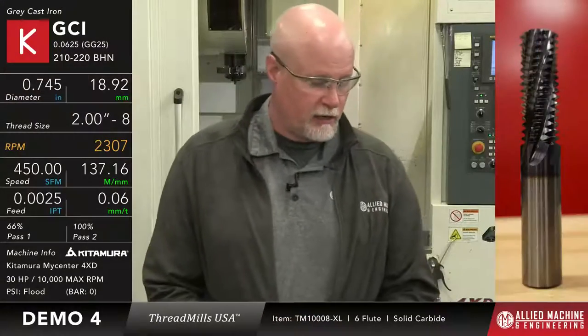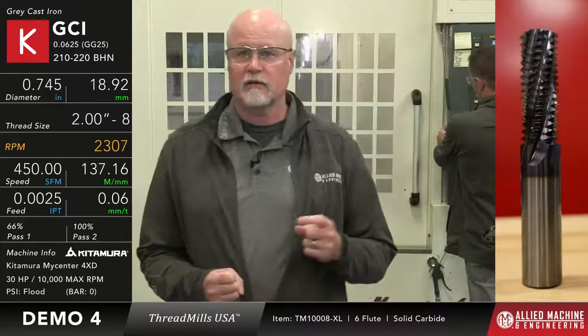Okay? So we're going to move on to our last demo for you here today. We're going to do a large diameter thread. Remember that first demo we did that was the half piece. We did a 2-inch 8 thread. Well, what we're going to do is we're actually going to do that in a whole application. So we're going to go back into gray cast iron, but instead of doing a half cut, it's actually going to be a regular cut for this, so we can check it. Okay.